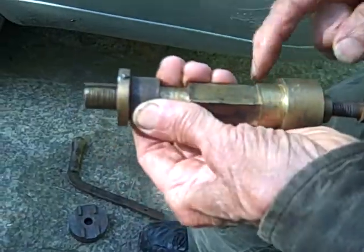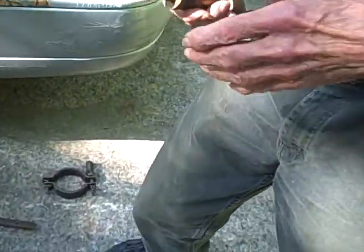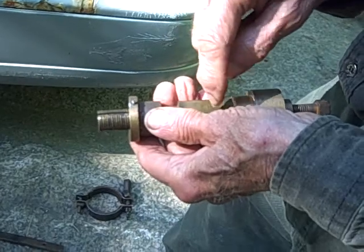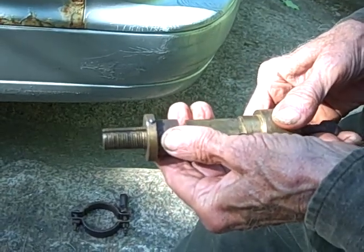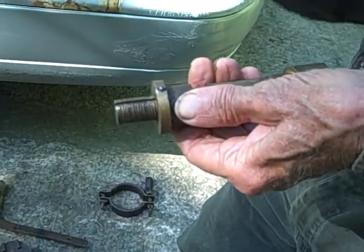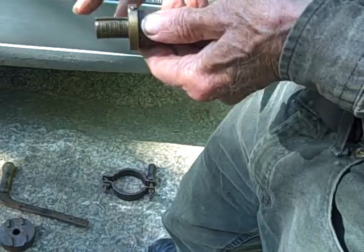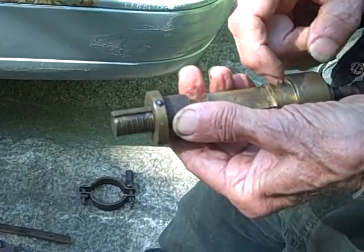When you're tightening that up, you have to release the clamp on the skeg, which is right here, because the skeg is going to move sideways at the same time. So you always take the cover plate off, you loosen that up, and as you tighten it up the shaft shifts a little bit more over — more to the port side of the boat. You have to allow the skeg to kind of be in the center of the device. Eventually it'll just move over and hit one side, and then you're only able to tighten up the packing gland on one side but not the other, so it won't work.